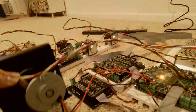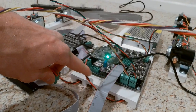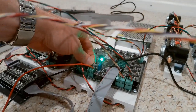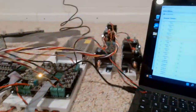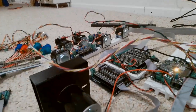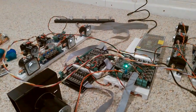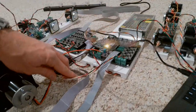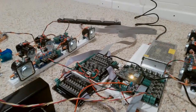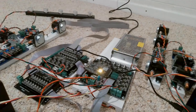The next thing is the shaker motor. Again, that's just going to be another plug, and that plug is right here — it's the one labeled plus, 11 and 12. It'll plug in there and then your shaker motor is ready to go. This little knob here will adjust the intensity of the shaker motor. If I turn that on now you'll see it wants to take off running — if I turn it all the way up it would go crazy. So that's your shaker. You've got all your 10 solenoids hooked up, got your shaker hooked up. You can route these wires however you want inside your cabinet to make it look clean — everything is either ribbon cable or one clean set of wires.